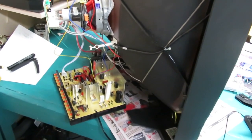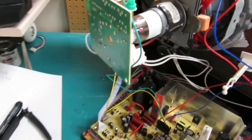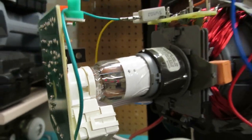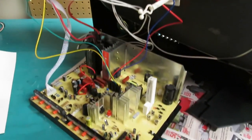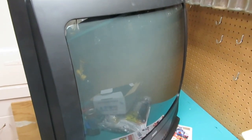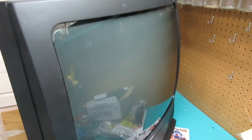I heard the high voltage; don't see anything on the screen but I believe the TV is on. I believe there's some glow — maybe this is okay. I don't see any smoke from the resistors, but I also don't see any picture at all. Let me get some sort of a signal generator and hook it up to see exactly what we're getting.